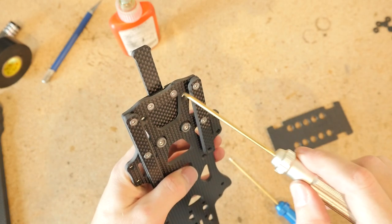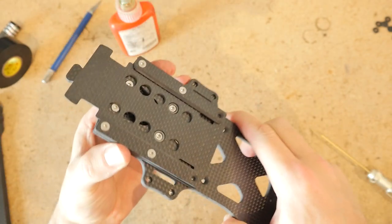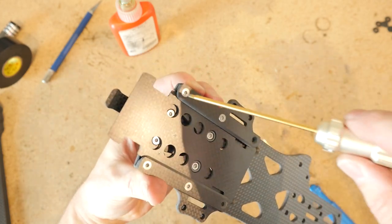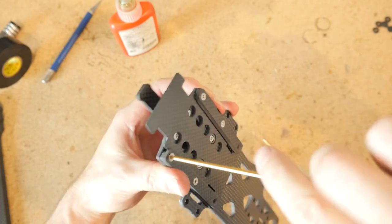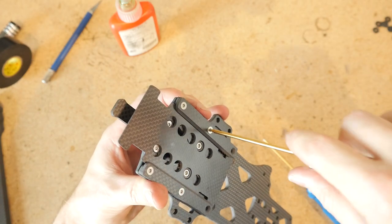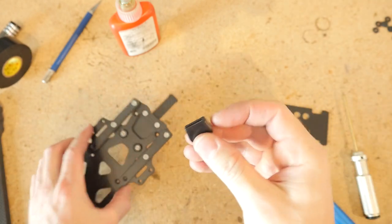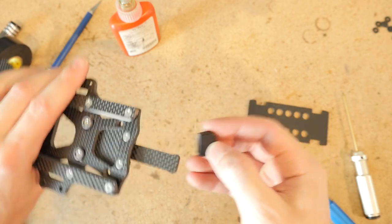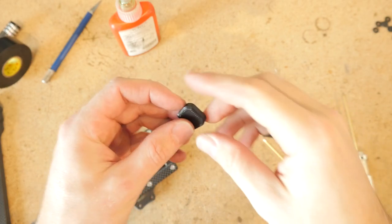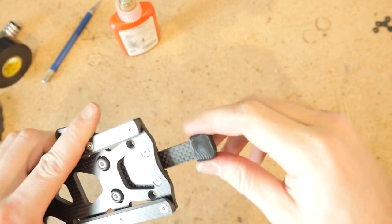That's a nice snap. Do a final tightening, make sure it's all the way down. Then re-insert the battery plate and give these battery rails a nice squeeze to take up any slop. Tighten down on these countersunk screws to secure the rail spacers in place — only about 75% tight since we still have to install two more screws later. Then fit this little TPU mitten over the top of the tab to prevent carbon fiber splinters. Heat it up with a heat gun so it fits easily over the battery spring tab.